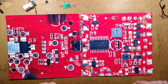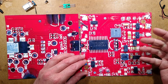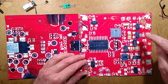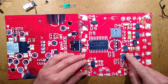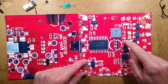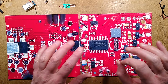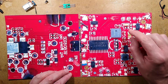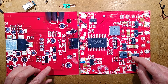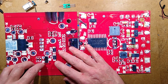There's some very interesting regulator and enabling circuitry. We have a three volt regulator — I couldn't find these components easily. There appears to be a transistor switching the negative for this regulator and another regulator. This one, with this little inductor, produces a five volt supply. That one produces a three volt supply. It looks as though this transistor is controlled from that chip. This transistor switches the infrared LEDs, and another transistor is an enable transistor that enables that transistor but seems to possibly enable other circuitry as well.